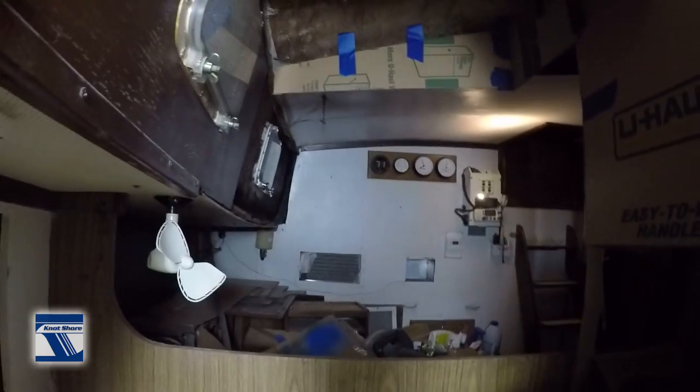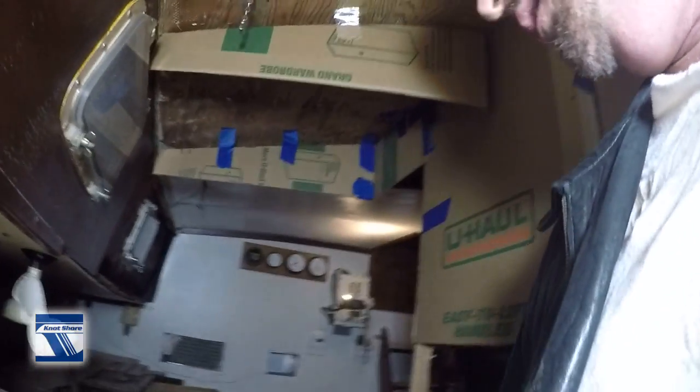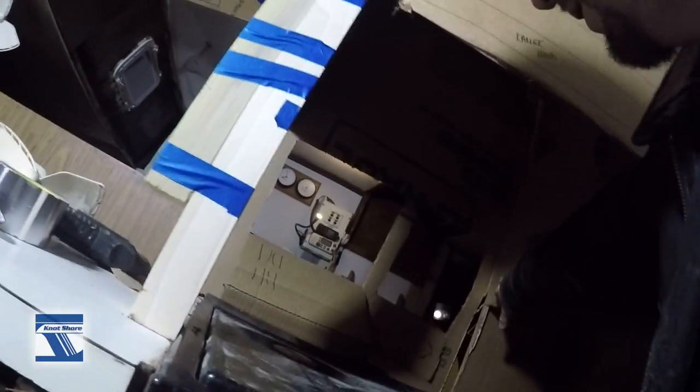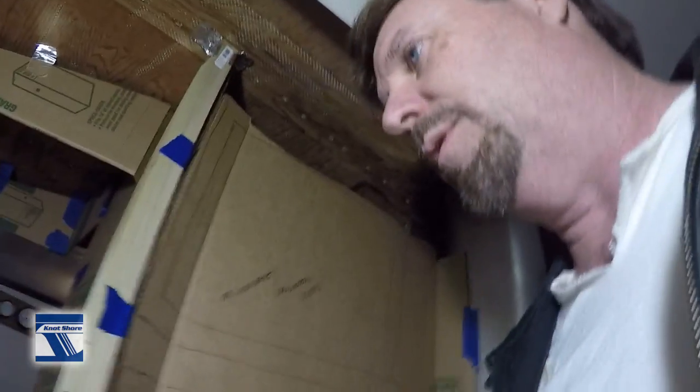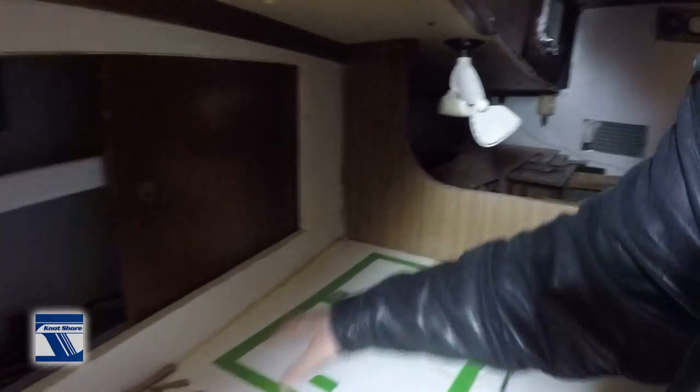Okay. We have a FoodSaver, one of the vacuum seal things, and we're planning on using that a bunch on the boat. So it's got its own little place right here to sit, but obviously it can move. I'm planning on putting a receptacle probably somewhere right about here, so that'll attach to the microwave and convection oven. The range hood will be DC, so it's going to be hooked up to a different circuit on DC voltage.